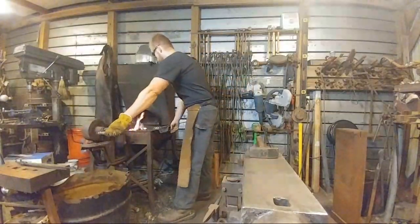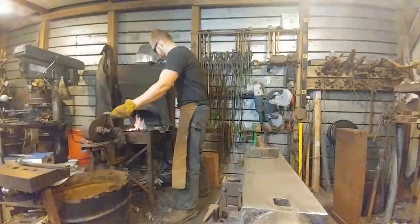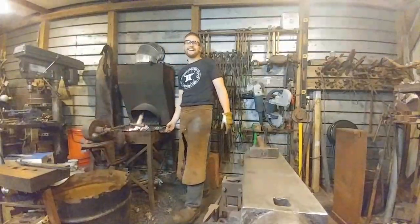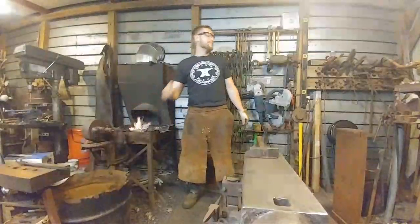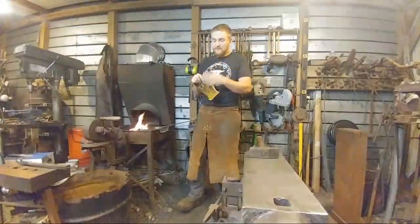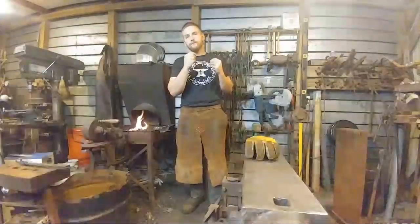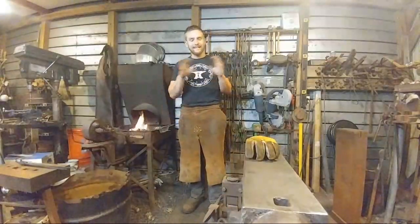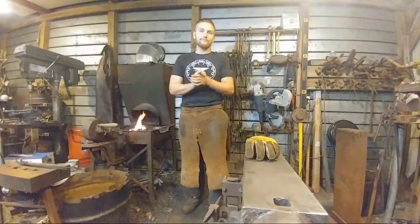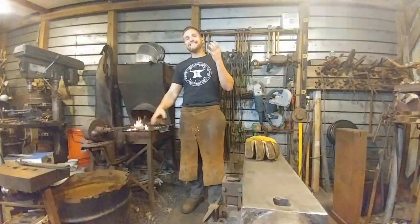What else? Corey Shire says, Roy, are you a fan of the rounding hammer? I am not a fan of the rounding hammer. I've got a whole video on it, Corey. So I'll go ahead and say it in the live stream because I'm going to get asked this a lot, and I take some knocks for it. Use a hammer that you're comfortable with. If you enjoy a rounding hammer, use a rounding hammer by all means. But if you feel that a rounding hammer is so far superior to any other type of hammer out there, you're dead wrong, because there are certain jobs a rounding hammer just cannot do, won't do, and will not do effectively. And it's by its design.